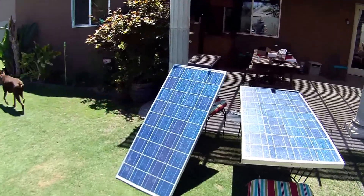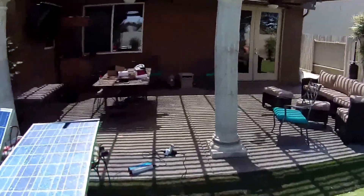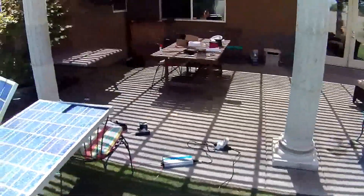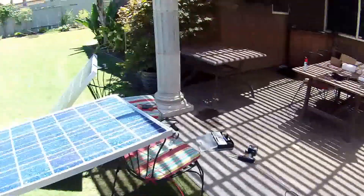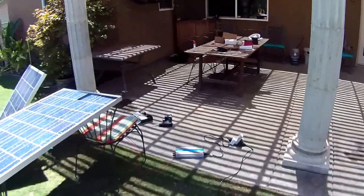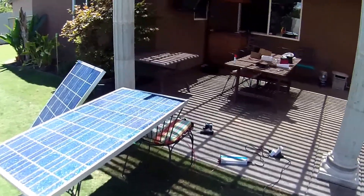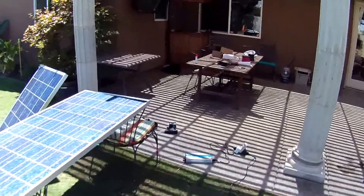I've got 10 of these panels at 120 watts each. They're not going to get maximum capacity — they're not going to overload this thing. If they each get 80 watts, I don't see them doing it. At peak power in optimal conditions, maybe, but I could hook up 8 or so to keep it under a kilowatt.